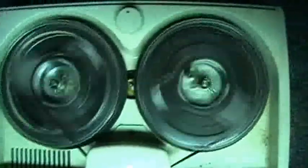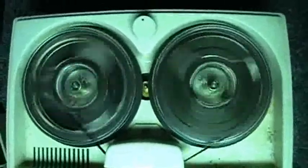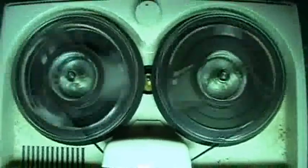As you can see, rewind isn't the fastest in the world. This is a rim drive recorder where the amplifier is pretty good design, but the transport just isn't the best design. There are some rim drive recorders where the rewind is reinforced by an idler to make it a lot faster. And also some ones that have a better playback torque too.